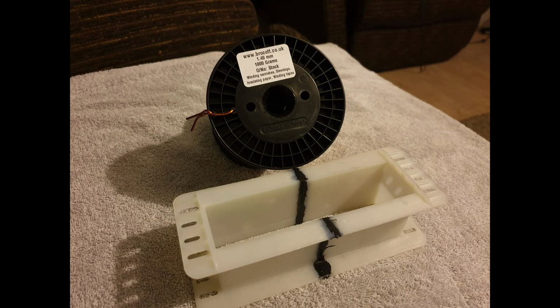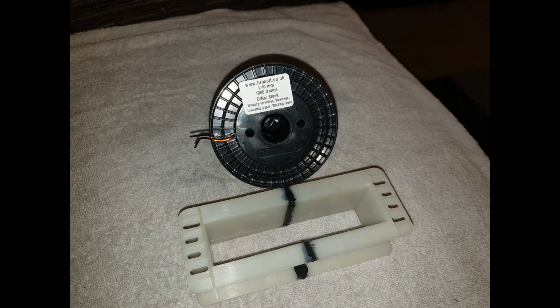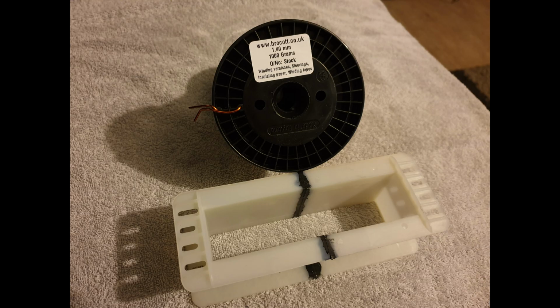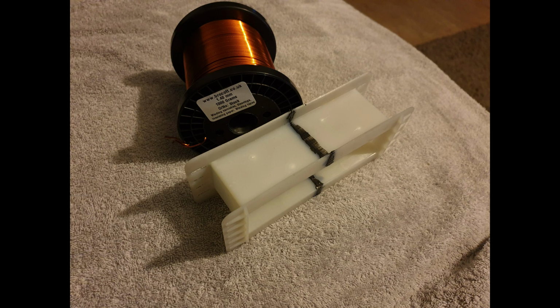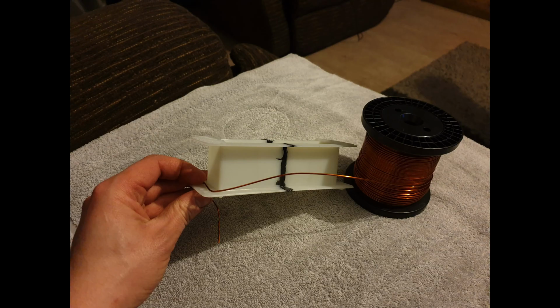This is the primary winding, double coated wire, so there are two insulators on it, two protective coatings. It's 1.4mm diameter. It's worked out from my calculations. How many turns was it again? 100 and something. That black stuff is the seam epoxy. They stuck the polycarbonate clear screens onto the enclosures.